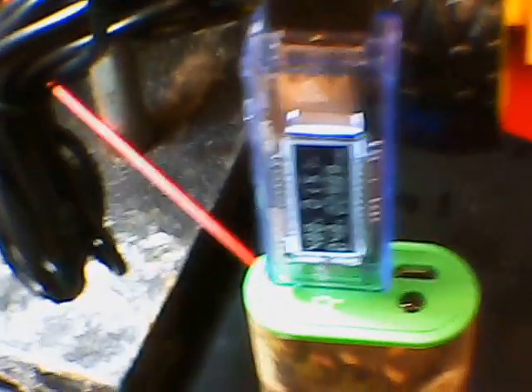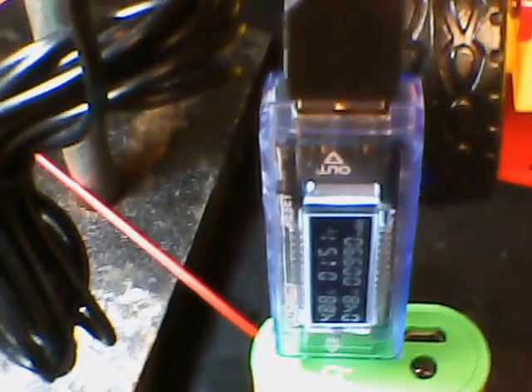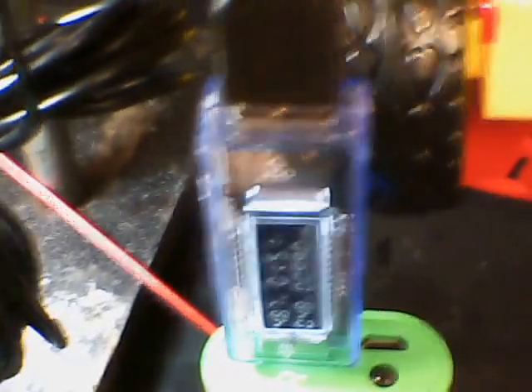What do I have it hooked up to? An LED. You can get these on Amazon. It's a 5 volt, 3 watt. That's just perfect — this multi-LED is just perfect for being able to determine what your milliamp hour will be. Sometimes I use power banks with four batteries — two, three, four batteries. So here I've got a couple. I'd say you can run one on a good 3.7 volt battery and get about an hour and a half. Then the voltage and the power output will drop and it'll shut off, and then you can come back and read your meter. I show students this is a good, efficient way to determine milliamp hours.